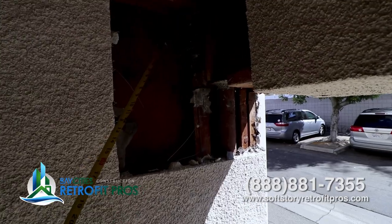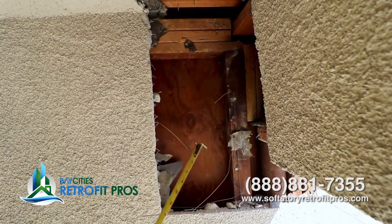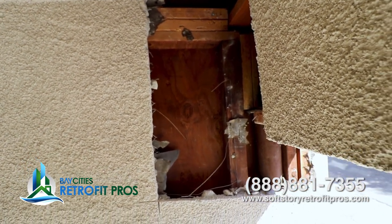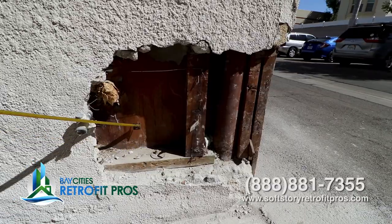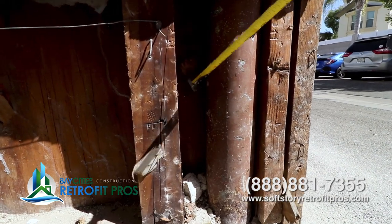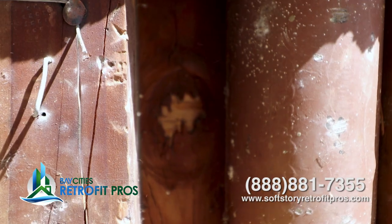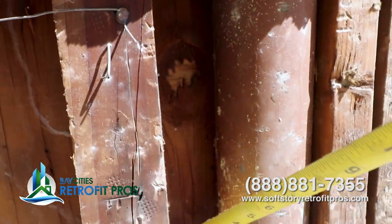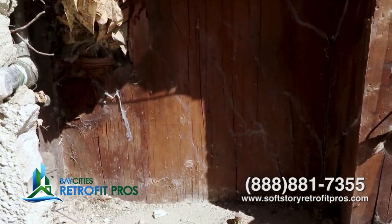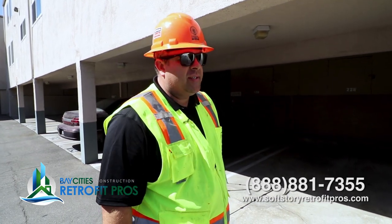There is plywood on the exterior of this wall. The question always becomes: what is the condition of the bases of this plywood? At the base, there's no real bolt there, and no significant damage on the base of this. We're always looking for stuff like this — this is a knot that blew out. There are really wide checks on the surface of the plywood. That indicates they're dry. You always wonder how much deterioration there is in the strength of the plywood when you have big wide checks like that.